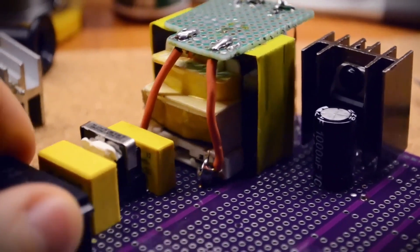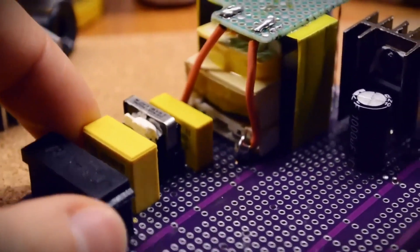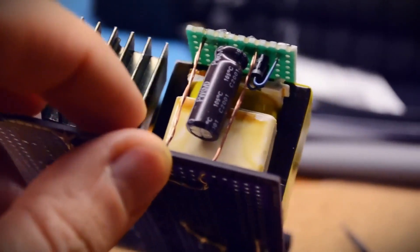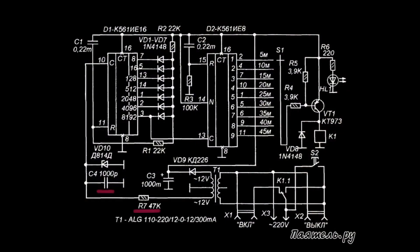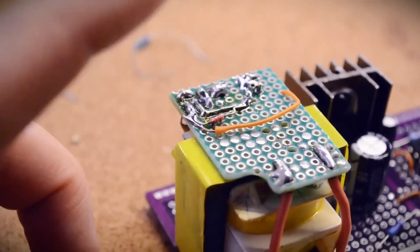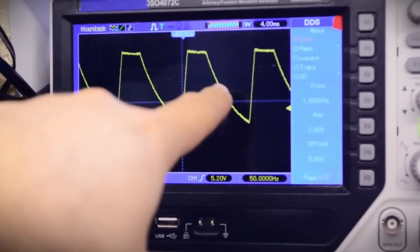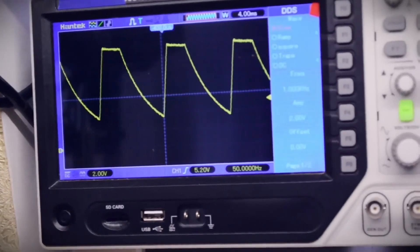The circuit essentially requires a step-down transformer because, in addition to rectified voltage and forming the supply voltage, we need to get pulses from the network and count them carefully with a counter. I installed a 3-terminal voltage regulator for 12 volts, but it wasn't necessary. At first I assembled according to the original schematic and nothing worked. This capacitor and resistor form a filter, theoretically blocking high-frequency pulses — the mains voltage is close to sinusoidal. As a result, the signal decay is significantly prolonged, and it's precisely this decay that the IE16 chip counts on. Due to the prolonged decay, the chip starts to malfunction.